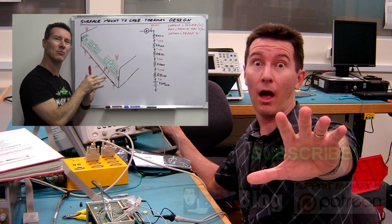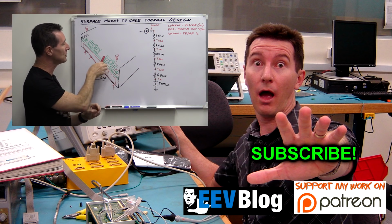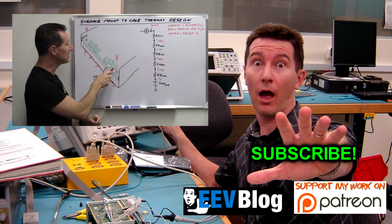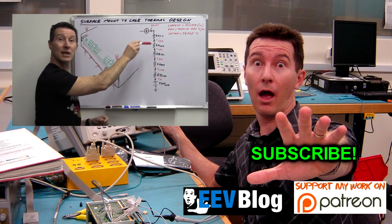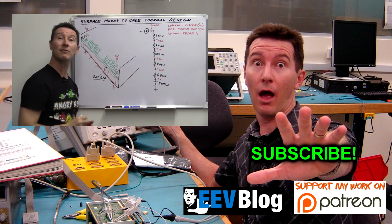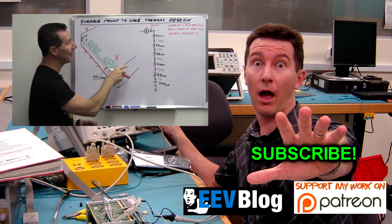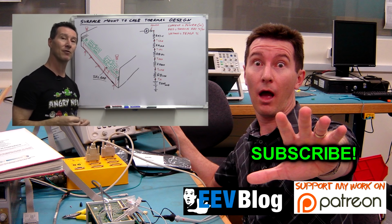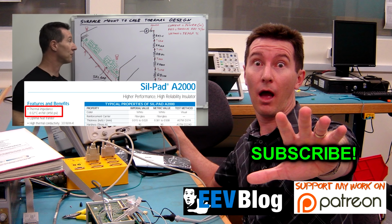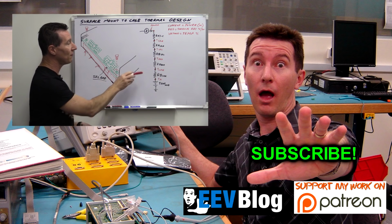The copper will have a thermal resistance too, but it can get quite complicated, so I'm just assuming there's no loss in that copper itself. The next one is the via. The heat actually has to, you remember that 10 watts of heat or whatever it is, has to transfer through the via. It's going to have a specific thermal resistance, and then it's got to get through that sil pad that we put in there. That sil pad will have a thermal resistance. Look up the data sheet for it, it'll tell you what it is typically. And then we're going to have the thermal resistance of the bar here.